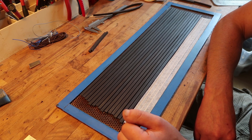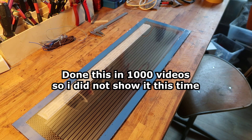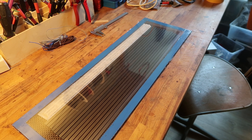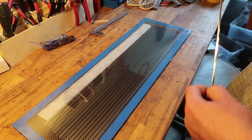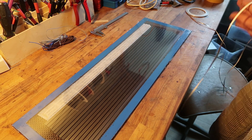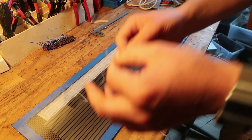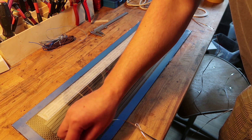The tweeter magnets are so small you can hardly see them, but compared to rubber magnets they are very powerful. Even as pure ferrite they'd probably already be stronger than the rubber magnet, which is a really weak kind of magnet but very nice to work with. If you want surface area and lots of turns, rubber magnets are quite a good solution — cheap and nice to work with. I'll attach the mylar using some sticky tape because it's easy.